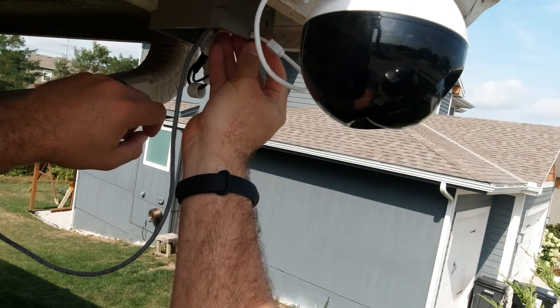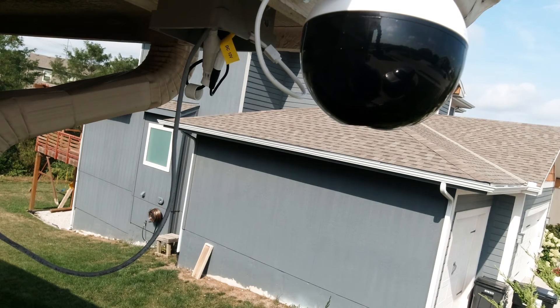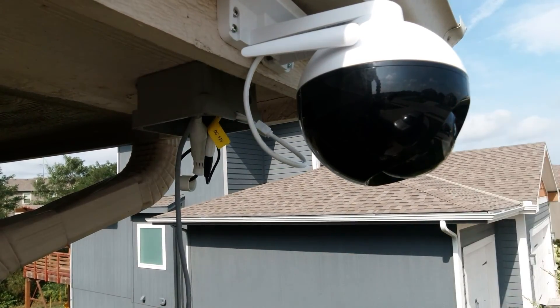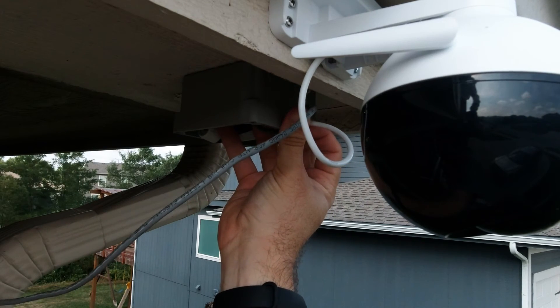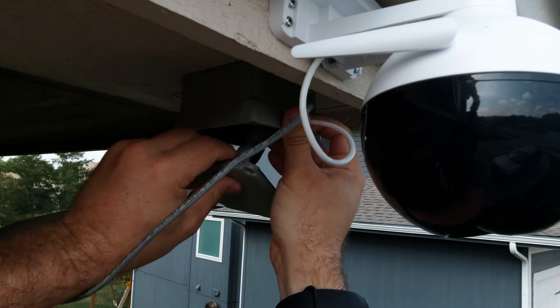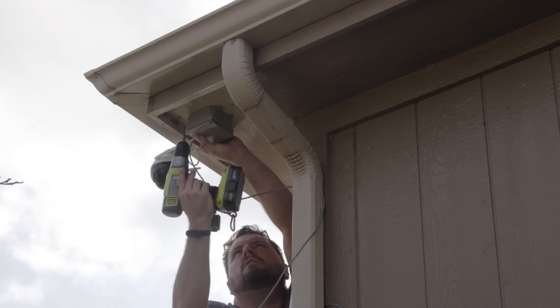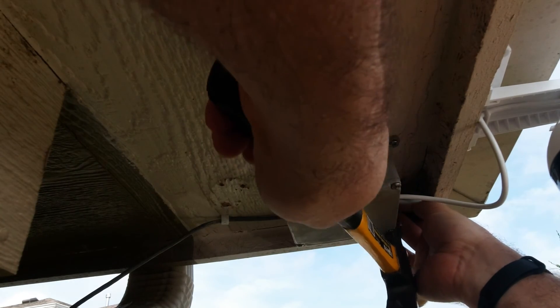The waterproofing kit didn't exactly fit over the power over ethernet adapter, so I just went ahead and installed it with it on there — it's not doing anything, but it's inside the enclosure so it doesn't really matter. Once everything was plugged in, the dome itself started moving, so we know power has been applied and everything is functioning as expected. After a quick application of some electrical tape to close that extra hole, we grabbed everything into the enclosure and sealed it up, keeping the cables neat coming out of the box. After screwing the enclosure back together, I applied some cable management to make sure the cables stay neat and tidy and don't move around in the wind. Then I tucked the rest of the service loop into the downspout.